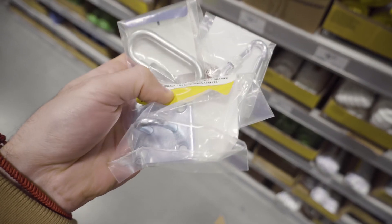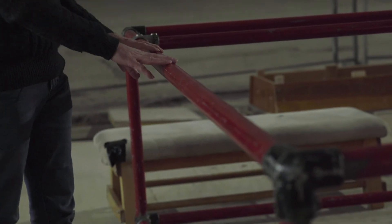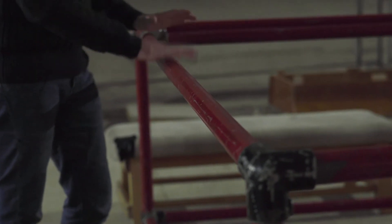Let's look at some bad examples — things that you shouldn't do. Most equipment available from hardware stores is not suitable for setting up your rigging point. All equipment should have a CE mark or a UKCA mark and be purpose-designed for supporting people. These plates and eye bolts commonly used to screw directly into wood are likely to weaken the beam you're screwing into rather than create a strong rigging point — do not use these for acrobatic rigging. Creating your own rig out of wood or scaffolding is a risky proposition unless you have the knowledge to calculate working load limits and manufacture within those standards. Scaffolding is typically not designed for that purpose, and while a particular type can be used for parkour training, we wouldn't suggest hanging aerial equipment from a beam like this as it's very likely to break under those loads.